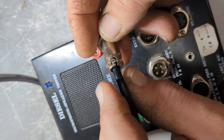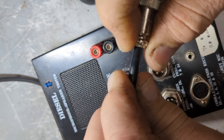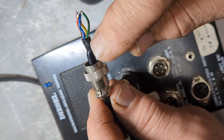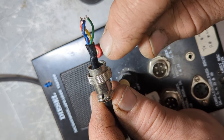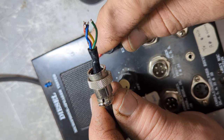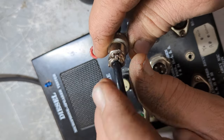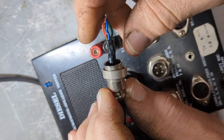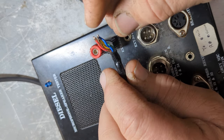Now some of these — if you tighten them up they won't grip the rubber cable very well. So what you can do is if you have another one of these old cords laying around, trim it to make a half-moon shape and put that half-moon in there. It gives it a little wedge so it won't slide and stays tight.